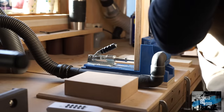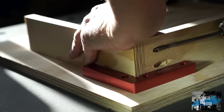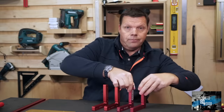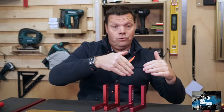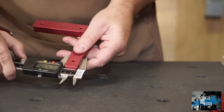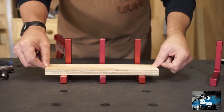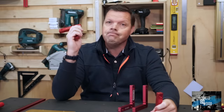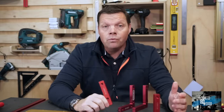I also use them as a jig to align two boards when they need to be at an exact angle of 90 degrees. These clamp squares come in various designs and I like this one the most. What I particularly like is that you can screw them onto a board, which is very helpful when making a series of drawers — consistently and fast. When making drawers with a pocket hole, for example, you can easily put them together without worrying that the pieces shift during assembly. I think you need at least two of them, but you will probably end up with four. My advice: immediately buy two or four of the same version to guarantee matching dimensions, as I made the mistake of later buying from another brand and they differed slightly. It is a really nice product that every woodworker needs.